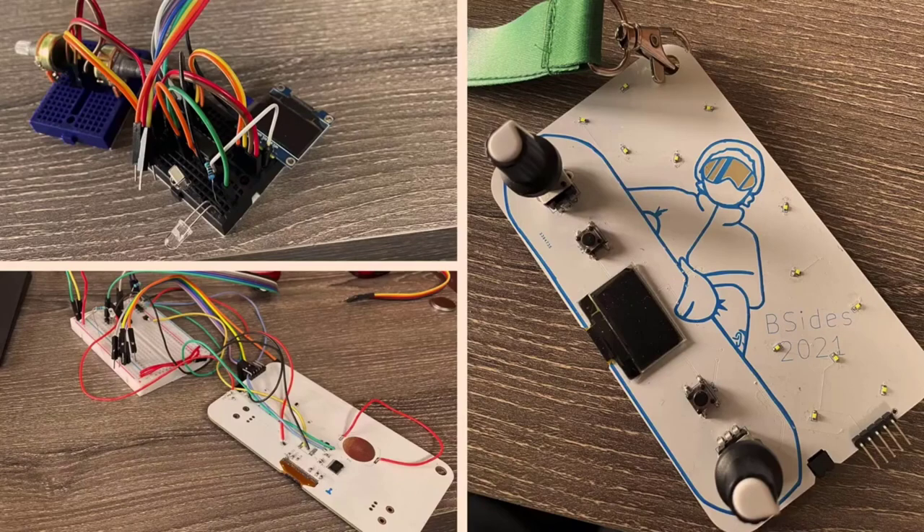Once that's done, I designed a prototype board and soldered all the pieces on it. But I totally messed up on my prototype board. I switched from Eagle CAD to KiCAD, and it kind of bit me because I put the footprint for my chip on the board but had the pin assignment all wrong. I couldn't place my chip because the pin layout didn't match, so I had to have all these jumper wires over to a breadboard. That mess on the bottom left is my prototype with an additional breadboard to fix my design mistake.